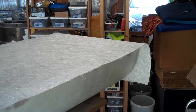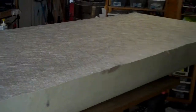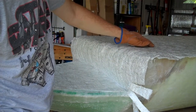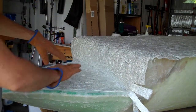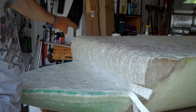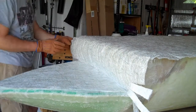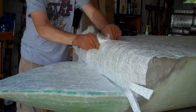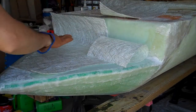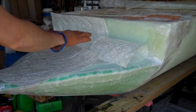At 11 feet 9 inches, this is the longest single piece of chop strand mat that I lay down on a pontoon. I laid this out as a single piece but I'm actually going to be putting the back edge and the top arm separately from this front cover. This front cover is going to be on top of a few extra pieces I'm putting down here — I want a few extra layers here to support people stepping down onto a beach. So instead of cutting this nice and evenly, I am going to be ripping it to have a frayed edge deliberately, so that I can blend those edges back in a little bit better. These are some scrap pieces I cut to shape to mostly fit together, adding an extra one-and-a-half to two layers here to reinforce this top step area a little more.